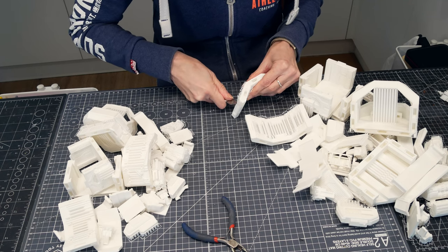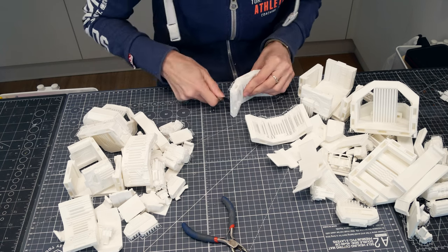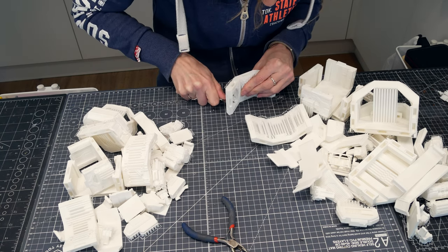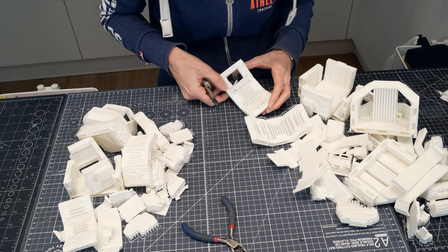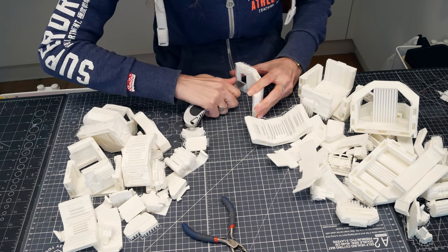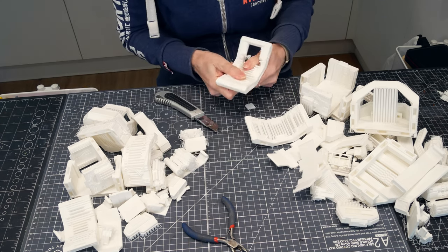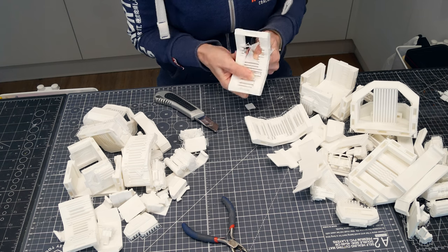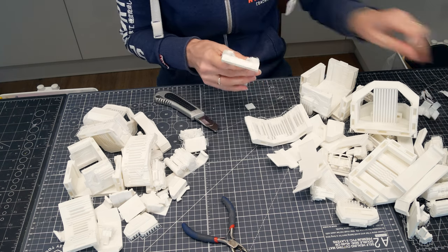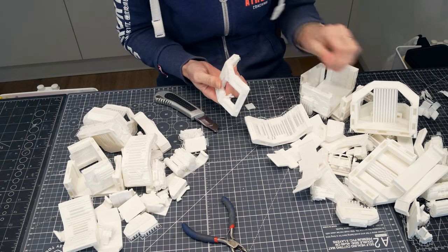I wanted a 35mm interior, but it makes it a bit bigger. These are taxis, so one is like a personal taxi — from the outside you can just put a couple of people in — and the other one looks like the party bus of bad taxis where you can get an entire herd of Banthas in there. Now if it sounds complex to get from 28mm to 35mm, it really isn't. You take 35 divided by 28 and you get 125%, and you just change it in the slicer.